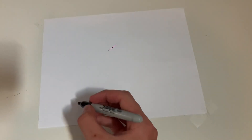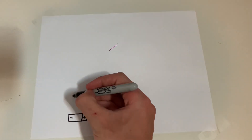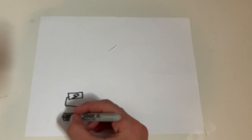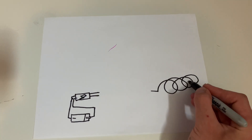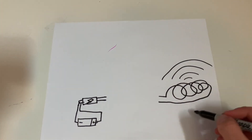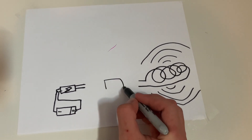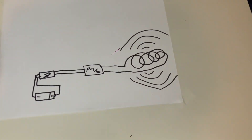If you don't know what an EMP is, I'll explain it. Basically, you start with a power source — something like a battery — and that goes through a high voltage transformer, which transforms it into a higher voltage. Then this electricity goes into a coil, and this coil is what creates the electromagnetic radiation. For the pulse part, we need a pulse generator, which goes in between the high voltage generator and the coil.